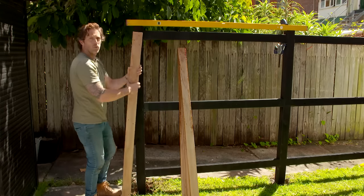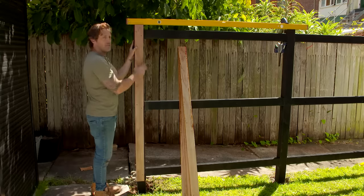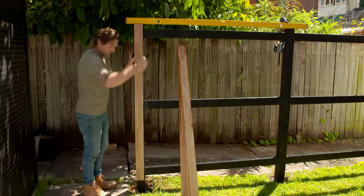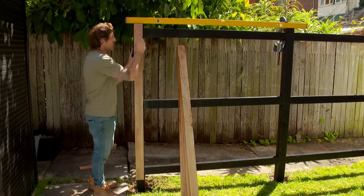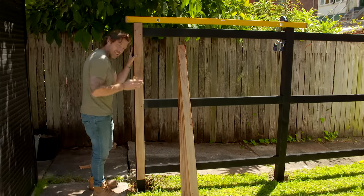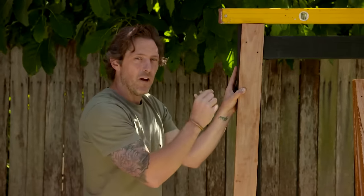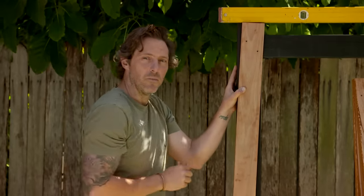When it comes to getting your screening boards on your screen, I've already clamped a spirit level to the top, so I know my top's going to be nice and level if I just use that as a guide. I'm also going to use the plumb line of the post for my first board. I'm going to put one screw in the top and one screw in the bottom and leave out the middle. I'll use a packer to space them out and do five to start with. Once I've done five, I'll go back and pop the packer in the middle and screw the middle off — that way it's going to take out any bows in the timber. You'll also notice I've got offset screw marks. If I had them all straight along in one line, it would never be perfect and would get really quite annoying to look at. By offsetting them, it takes out those millimetre imperfections for a much more professional look.